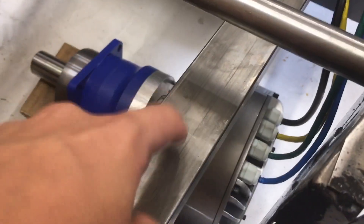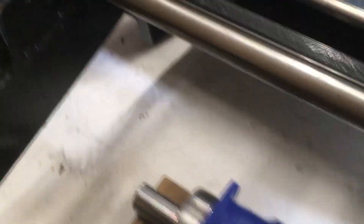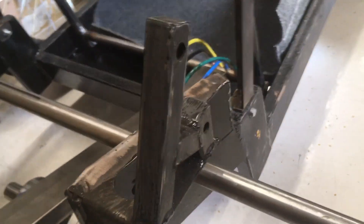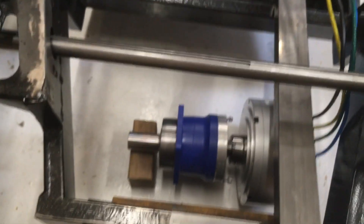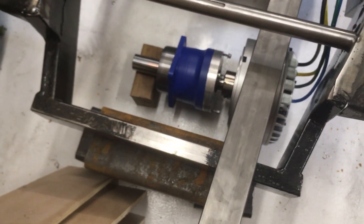The bracket could have four bolt holes, two for each of the rails. These rails could either have holes or slots so that I could adjust the chain tension. That's the sort of distance between the motor and the rail — that's how much it'd be off the floor, which I think is approximately at ride height at the moment, only approximately — so it'd be similar to the lowest point of the kart. But with an aluminium plate underneath I don't think this would be an issue. I'm wondering what people's opinion on this is — so I can make the mount the first time and have it work the first time, hopefully. What do people think? Do people think I should do it completely differently? This is my drivetrain setup.